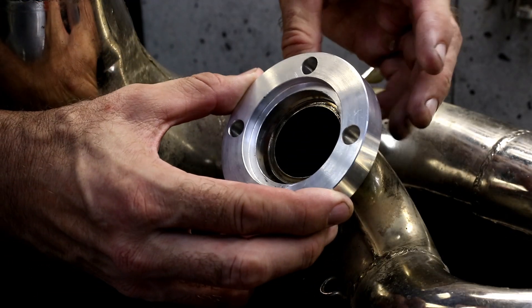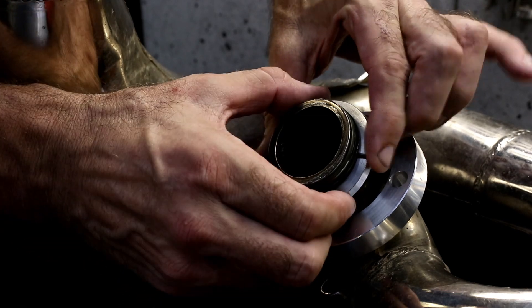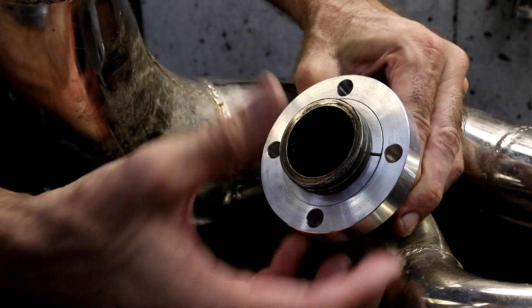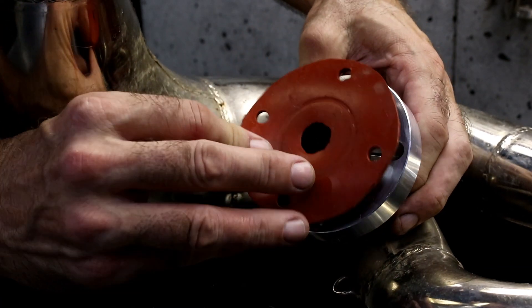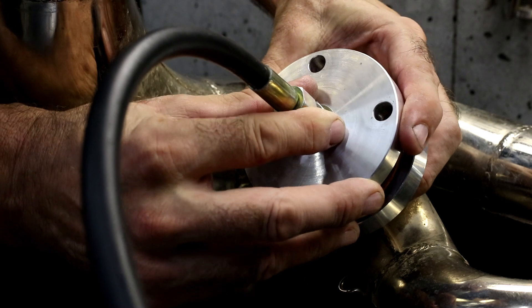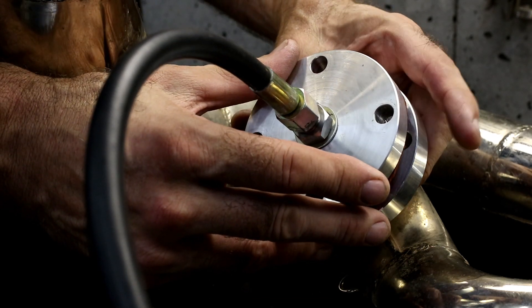The new pipe bung fits on very easily. It's got these two locking key pieces which go either side of the pipe. Once those are on, you just pull up the plate and these key pieces lock the plate in place, so when you bolt it to the other piece there's no way it can pull off. Then you've got your gasket and the other plate just bolts on. Very simple and extremely secure — pretty much no way it can leak if you bolt it up correctly.